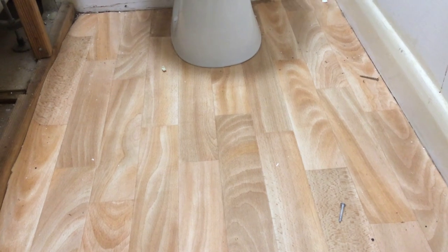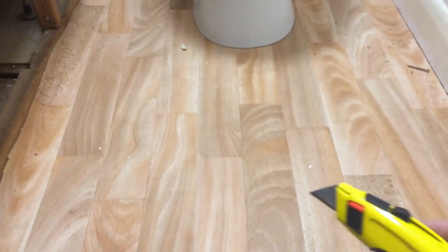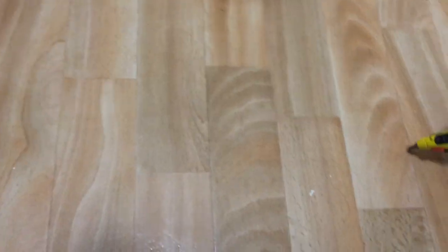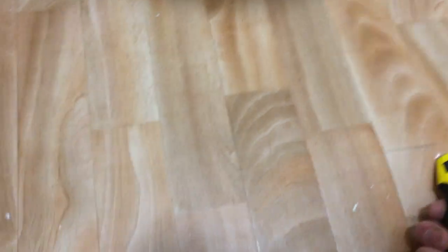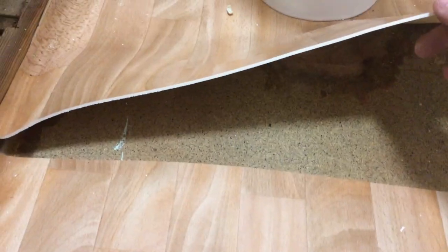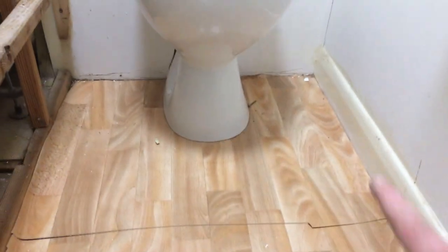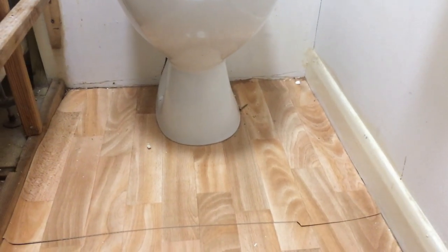Okay, it's in the process of taking out the bathroom floor - it's just lino. I'll just cut it with the utility knife, cut all that in manageable sections and remove that. I need to remove all this trim as well, just ready for the flooring, once I get the bath out.